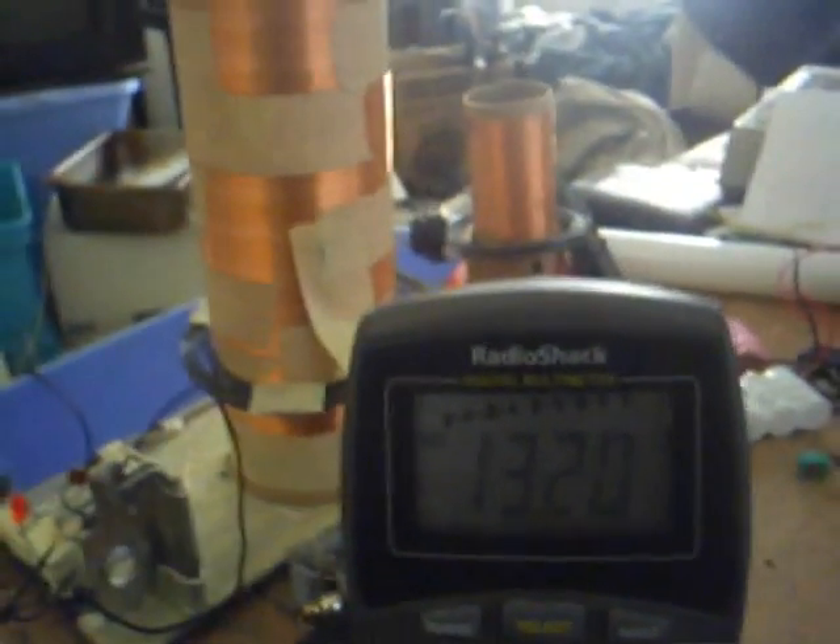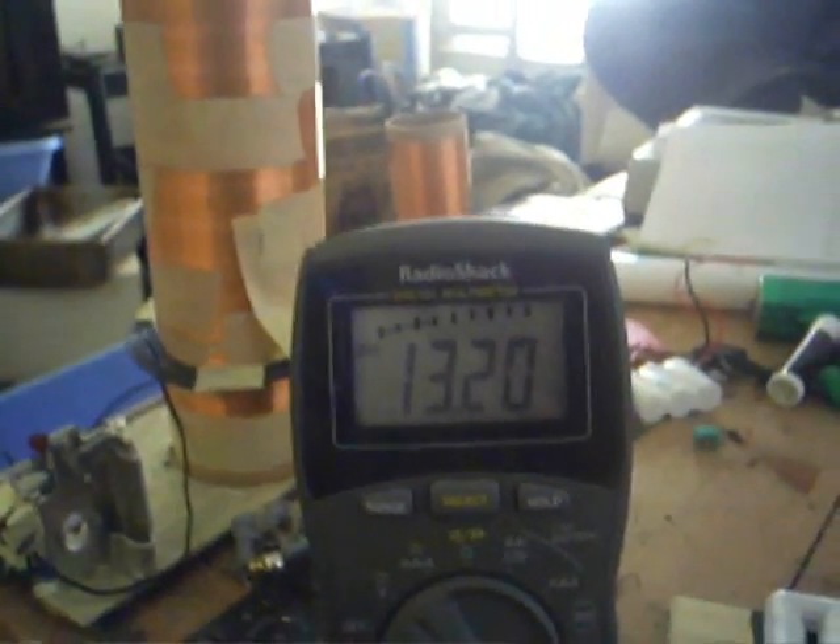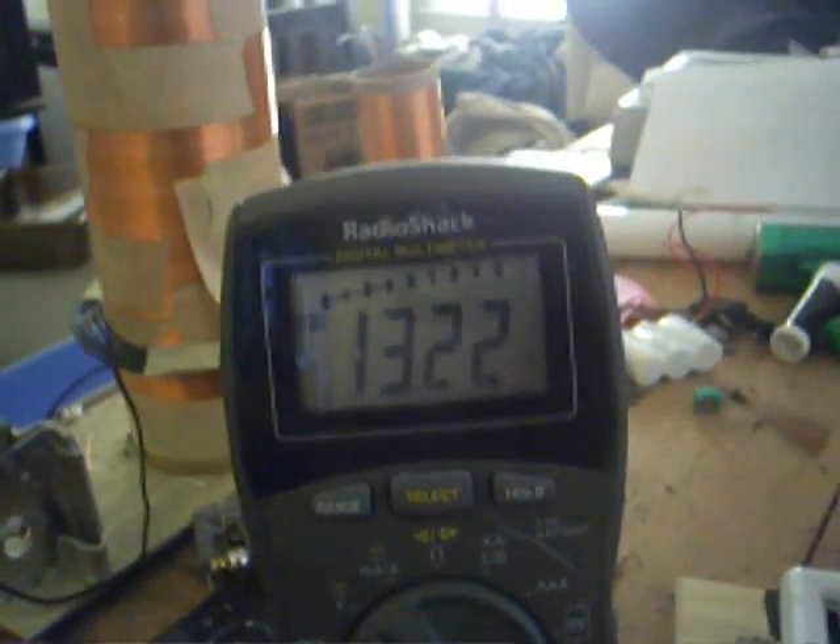You can see how fast it's charging. Now I'm going to switch it over to the high voltage mode. You can see I'm kicking out about 500 volts — I'm lighting this fluorescent — and what I have left is about 127 volts. That's what I would use to help restore a battery after I've hit it with the cap pulser a good while.